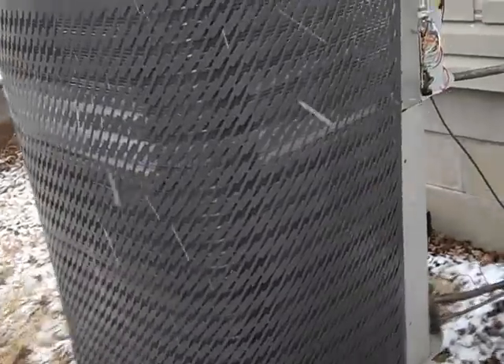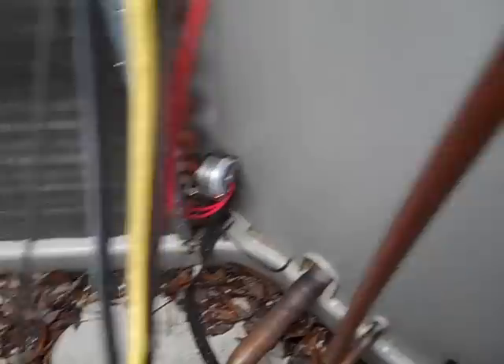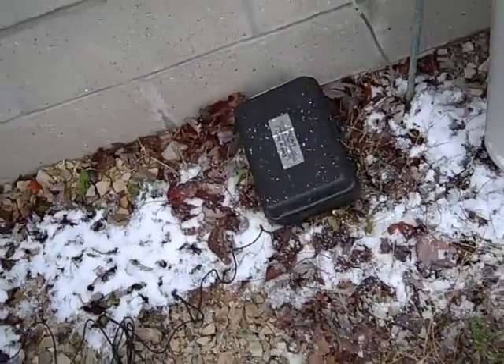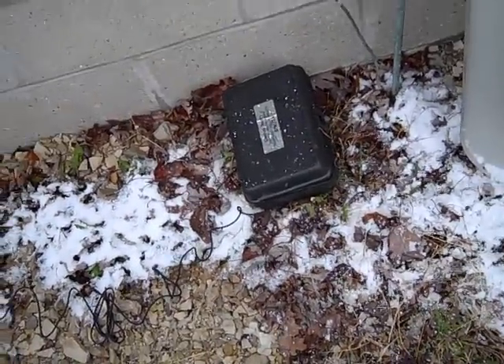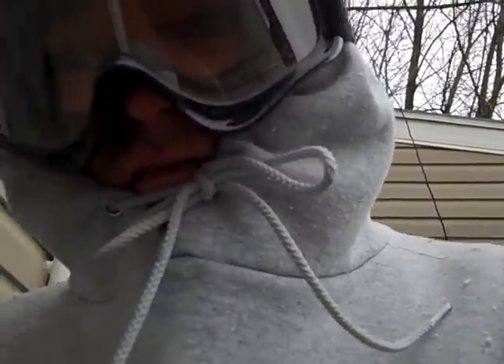It's a Goodman 12C unit. You'll see I've got the new defrost thermostat put in place, and there's a thermistor connected to the tube below it. There's my thermometer. Getting ready to put the fan on it and fire it up. We're going to test the temperature of this new thermostat to make sure that it's within range of working.